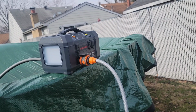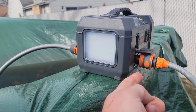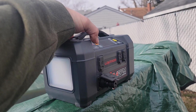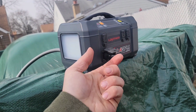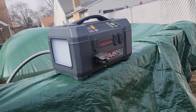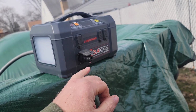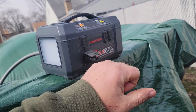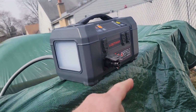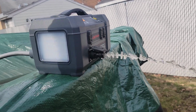But it can sense that those two plastic fittings need a little bit more of a snug. It won't leak on the suction side, but it will leak on the pressure side. So that's how you know you don't quite have it tight enough yet. And just so you guys can see it start up: once I freed that valve inside there by sucking on it, sucking on it again, then it freed up. But it's been sitting so long. So unless you give it a little, sounds terrible, suck on the end of that nipple and try to help pull that valve open, whatever's inside there, so that water can start flowing, it may stick on you. Comes out quick, kind of violent.